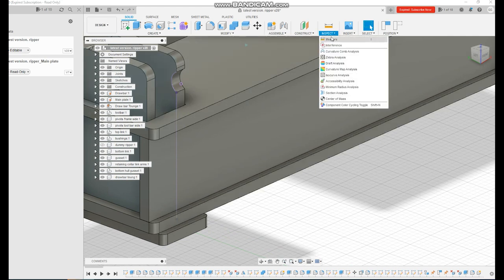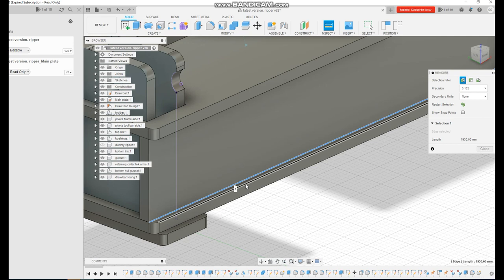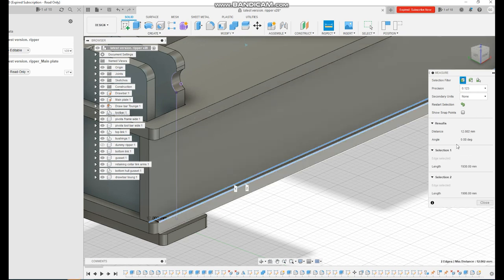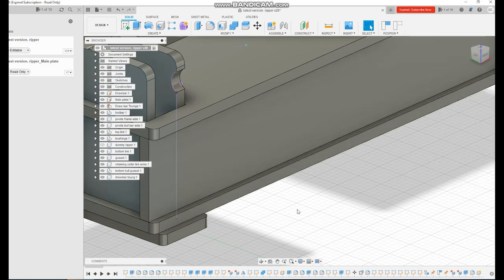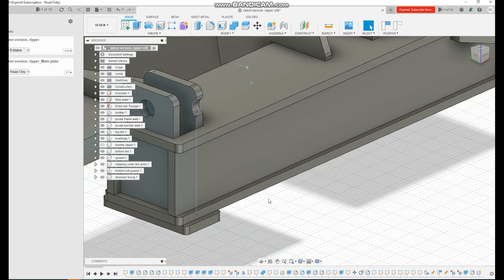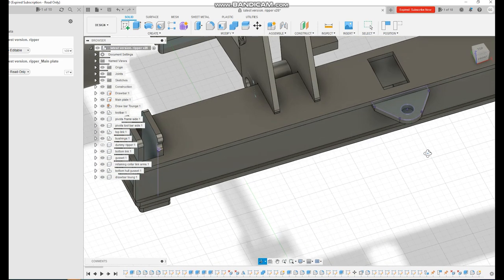Even this weld here that goes from there to there, I found 12 to 15 mil is a good measurement to have a nice fillet weld. If you go to less, you'll start to burn the edge. If you go to more, then you leave a big flat area there. So it's all that sort of stuff that you sort of consider.